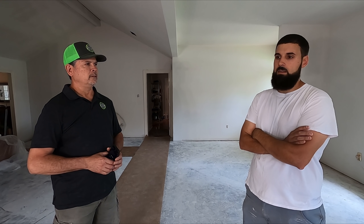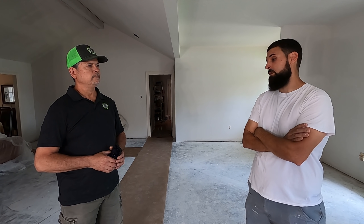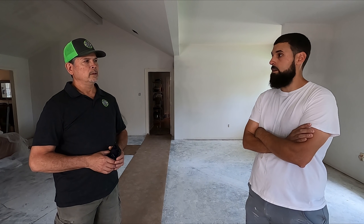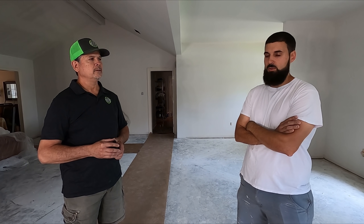Better than most when it comes to remodel. This is tough hanging in here — you got this 45 running across here, and y'all did a pretty good job on that. The easiest thing you hang is going to be fresh new wood where screws go in easy — that's not the case here. Taking that into consideration, I think y'all did a pretty good job. A few screws to reset, but it's better to have to reset them than have them too deep. Right now you're being nice because you told me about 60% of them needed resetting — yes, that's the truth, about 60% of them. Some of the existing drywall we re-nailed, put a screw in here and there also, but overall it was pretty good. I'd rather have nails hanging out than sunk all the way into the studs.